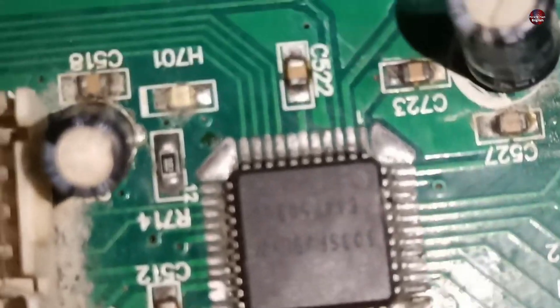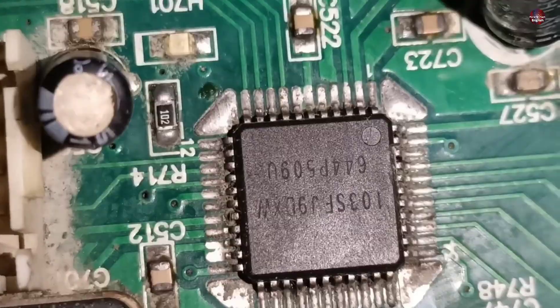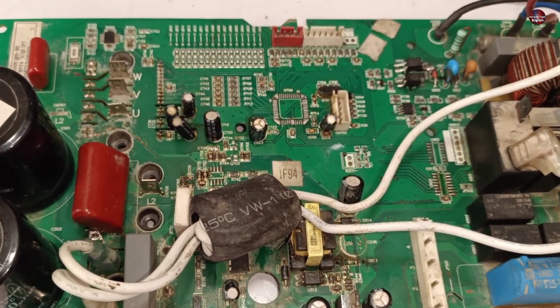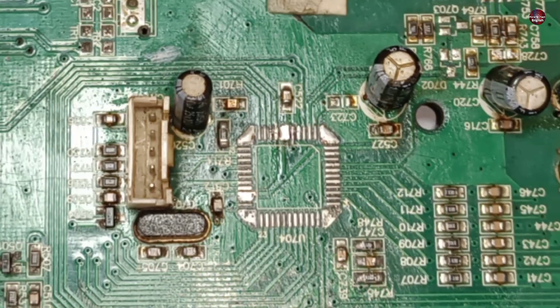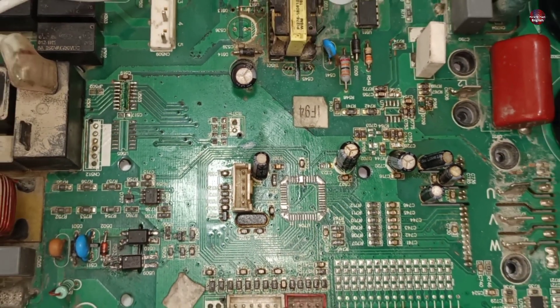After working on this circuit board, the short circuit was not fixable. I worked on the microcontroller and removed it from the board. After removing the microcontroller, the short circuit disappeared, which means the microcontroller also got short circuited. This is why this motherboard is not repairable. But the aim of telling you about the F1 error has been accomplished — I hope you understand.